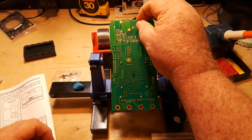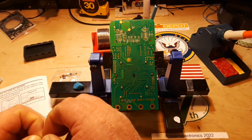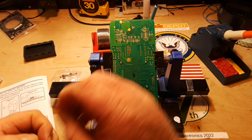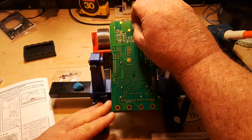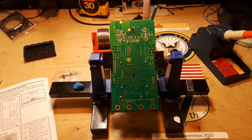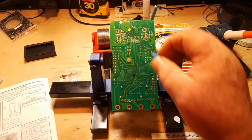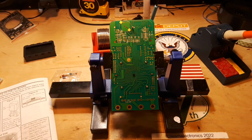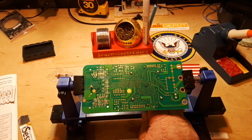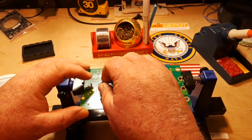Resistors are non-polarized. We are going to put all of our vertical resistors with the resistor side into the white dot on the board, as that is how they have advised us to do it. So that's what we're going to do. I'm going to have to change this. Hold on. There we go. It wasn't going to rotate cleanly in the other position.